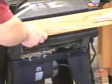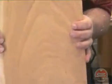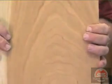Now, just keep it on the close up there for a minute, Drew, and I'll show you another board. Okay, it's in focus now. This has arrows, and there is a myth out there that says that the arrows point which way you should plane the board, and that's not true. What the arrows tell you is that there is a lot of grain slope. Look at the grain slope on the edge of this piece of cherry. See that? That's almost 45 degrees where the grain slopes.